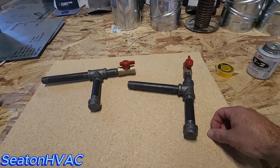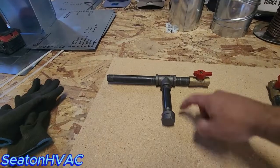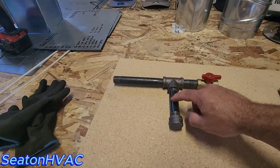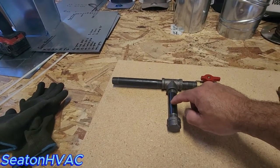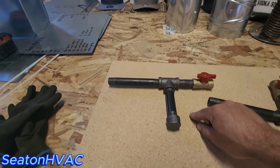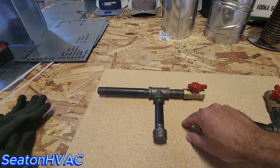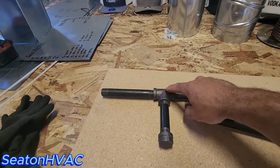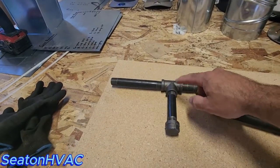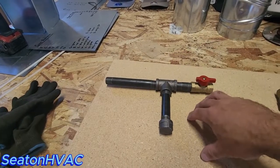The velocity and any gunk that's in there will blow through and drop in, and the gas will continue on to the appliance without all that crap in it. That's what you want. The plumbers in my area all do it the wrong way. I'm gas piping certified — I'm a master fitter. I have a master fitter's license to run LP and natural gas lines in residential homes and light commercial. I've argued with them; the inspector still passed these, and it's not right because this is wrong. Look at the code — it has to be like this. Our old house, the water heater, they piped it the wrong way. I changed it immediately because it was doing no good.